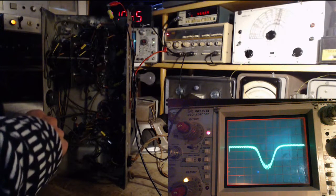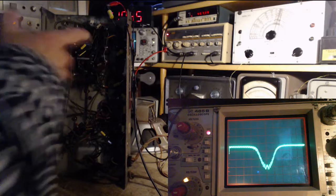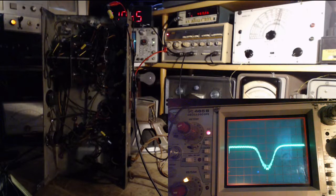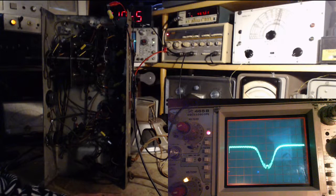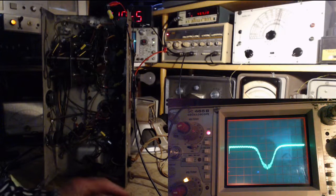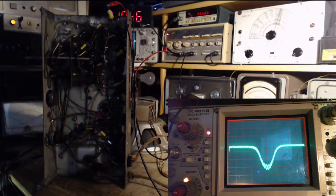Next would be to look at the signal as it comes through the front end of the radio and gets to this point. So I'm gonna stop and figure out how the heck can I do that. I can't really do that. But I can sweep the radio frequency through the antenna. And occasionally that frequency is going to mix with the local oscillator, produce 455 and show up. How's that help things? I don't know, but it sounds like fun to do, so I'm going to do that.